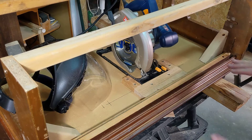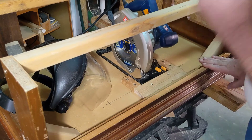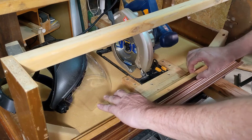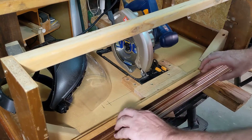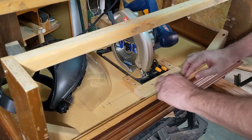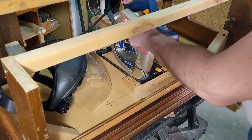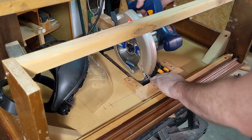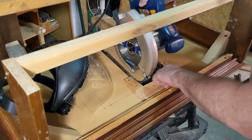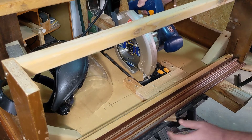This is the upside-down table saw table. I'm about to attempt to cut the all-important slot through from the bottom to the top. This is my reference point — this is where I'm going to be taking zero from zero angle. I've used two pieces of dimensionally stable wood as spacers, and I used those to screw these in so that this is supposedly perfectly square to this surface. Now I'm going to be driving it through, cutting through here. I've got some space under here and a piece of cardboard just in case it comes close to my table — it'll spit that cardboard out to tell me to stop.